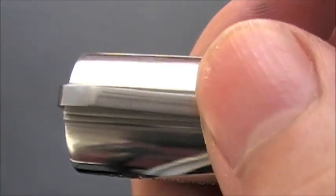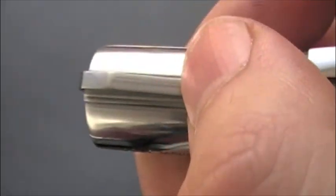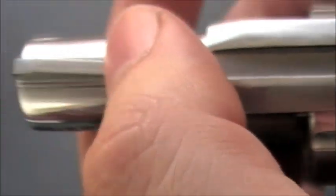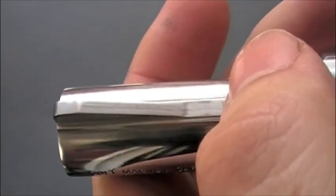Okay, now I have that sanded out to my satisfaction. Now this is where you need to know when to stop, because if you look there, you can still see a little bit of the line. It's not actually there anymore. If you run your finger across, it's totally smooth, where before you could feel the ridges. That's just the surface of the steel holding on to a little bit of the color from the sanding. Once you bead blast that out, that will completely disappear. As you'll see at the end product here, you won't see that anymore. So you gotta know when to stop and not overwork the finish.